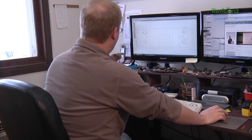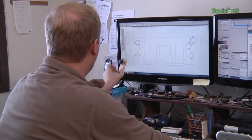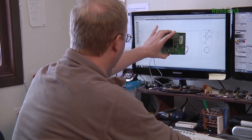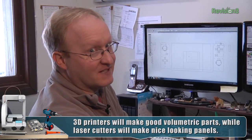So far, we've combined the LCD and the OUYA into one single unit so we can put it in a portable device. Then we took the controls and built them onto some perf boards by hand. Now comes the real hard step — designing the case. I've got to take all of these parts and draw them into the computer, one by one, make sure everything is fairly accurate. And then I can design a case around the parts, and we can make it using the 3D printer and probably the laser cutter.